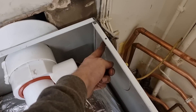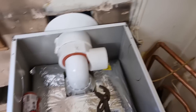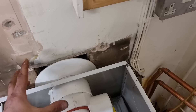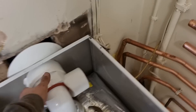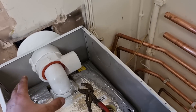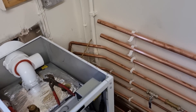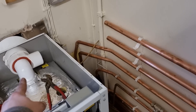The only thing I need to check on the flue is the instructions say you need a non-combustible sleeve where it goes through the wall. I haven't put one in yet, which is why I haven't made good the flue. I might need to get a metal sleeve. I can't see why they wouldn't send one if you needed it, but I do need to check with the manufacturer since I've not fitted one before. I always like to get the flue done first on an oil boiler — it gets everything lined up so you can see what you're working to.